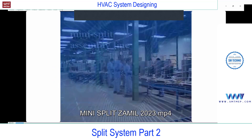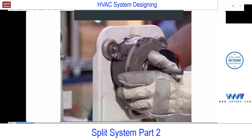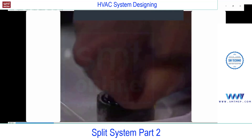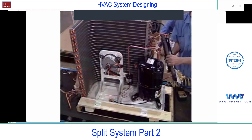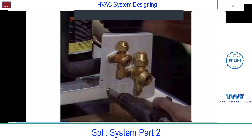All previous processes feed into the mini split assembly line where indoor and outdoor units are assembled and tested before packing. Starting with the base pan, here is a compressor — you can find these isolators, rubber to reduce the vibration — then the condenser fan with support, compressor, condenser coil, and interconnecting copper. Here is the condenser coil; tubes and coil guards are added.